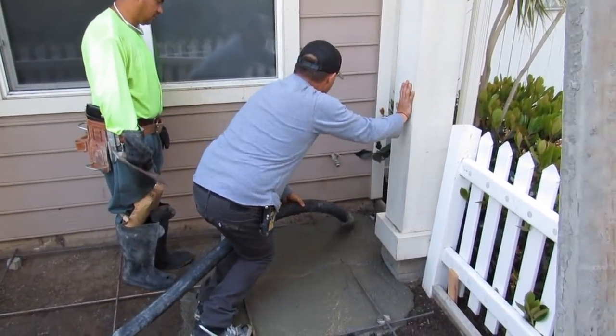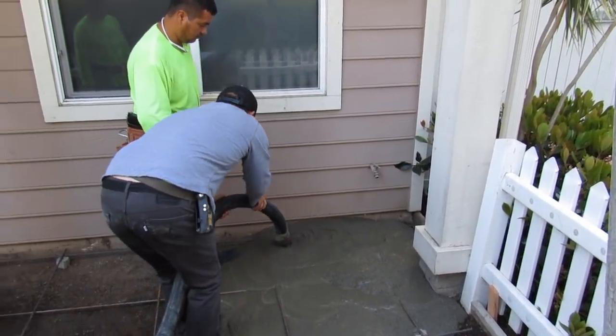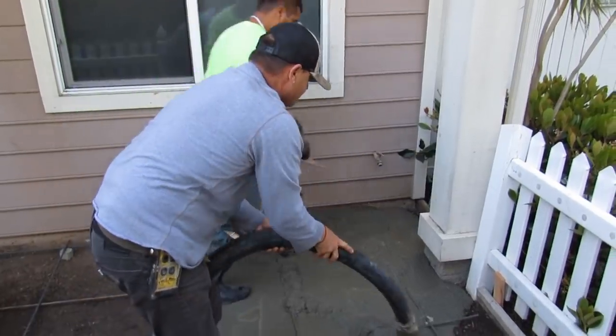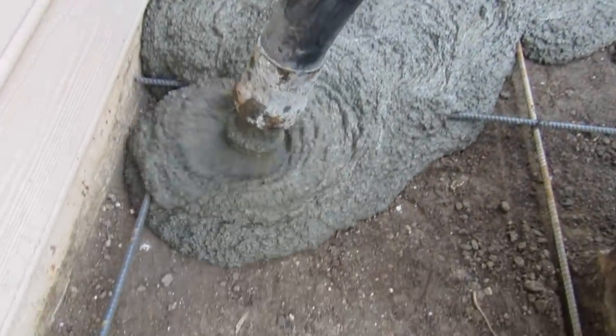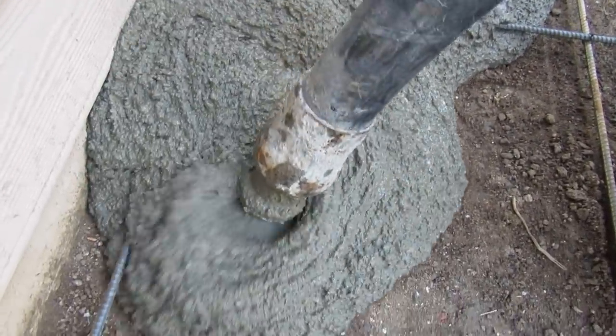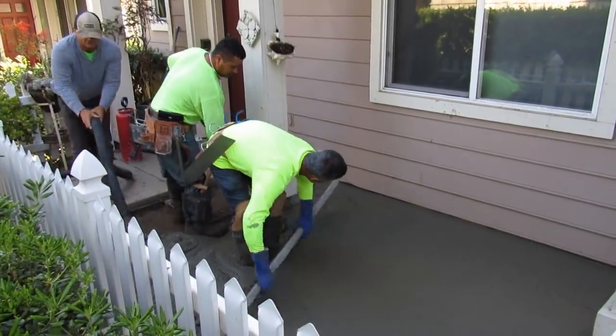See, I shot the prime in the wheelbarrow, and then the residual water that's in the line, there's nothing you can do because the wheelbarrow fills up exactly, and you got a little water left. So this corner hung up a little bit, but we knew it was going to happen. But see, then when you get to the regular mud, it's perfect, what you want about that slump right there. It's got 2% in it too.